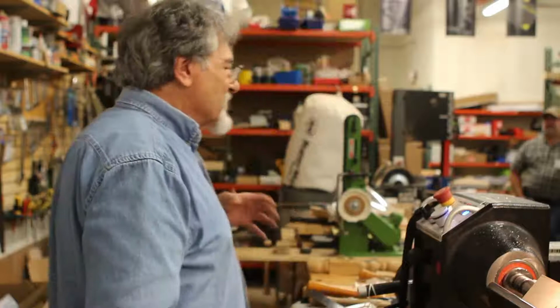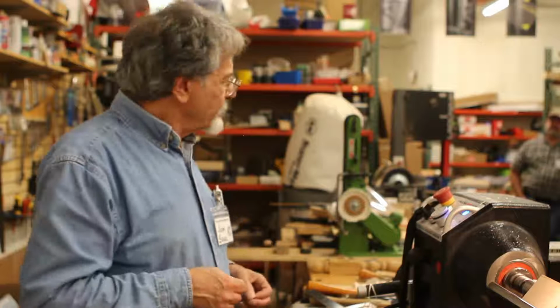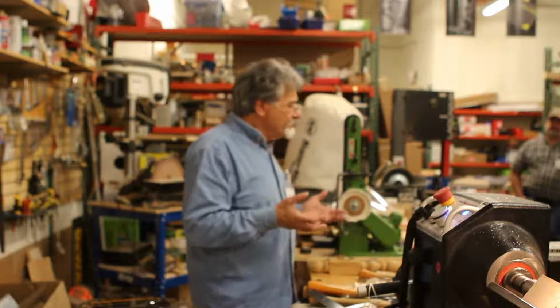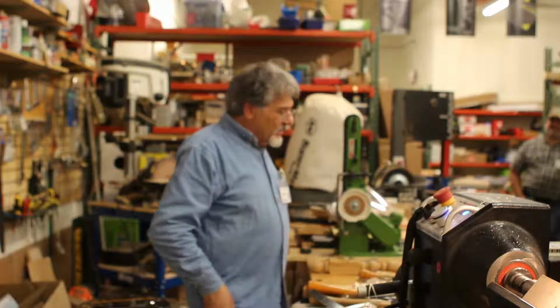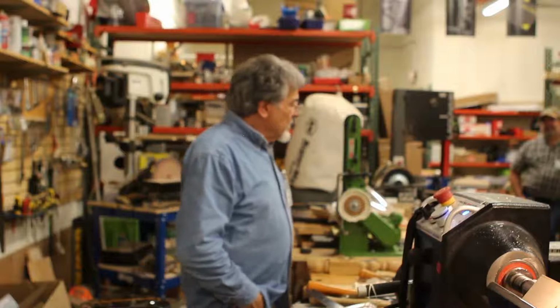Woods like oak are a little bit harder than this maple, because oak is a little more splintery. Sometimes people want oak balusters because they kind of look like chestnut. But given my choice in terms of architectural work, I would use maple if it's to be painted. I'd use soft maple, or poplar. This is poplar. I'm going to show you a few things.